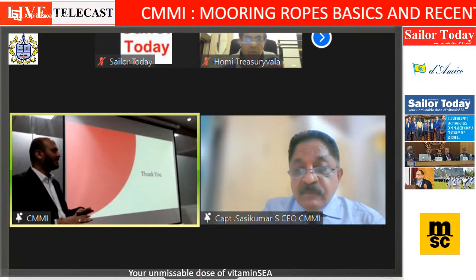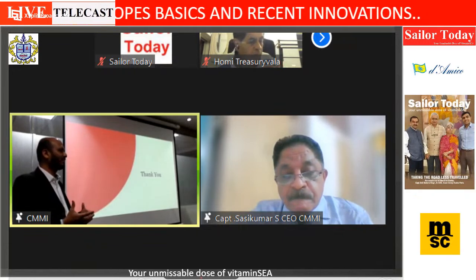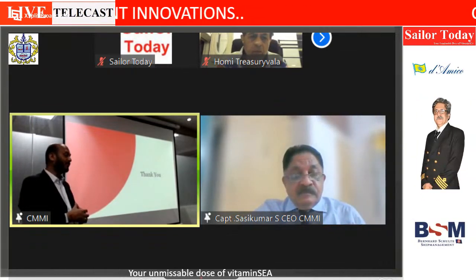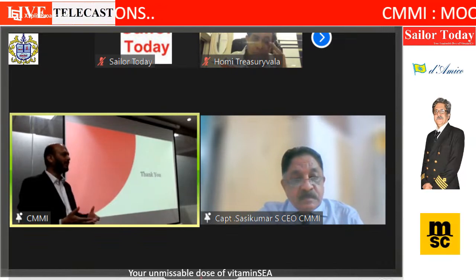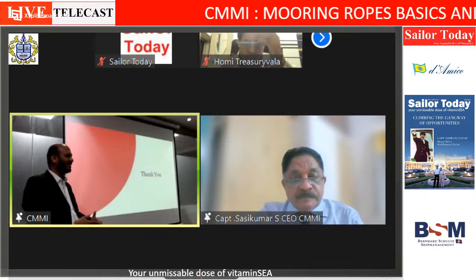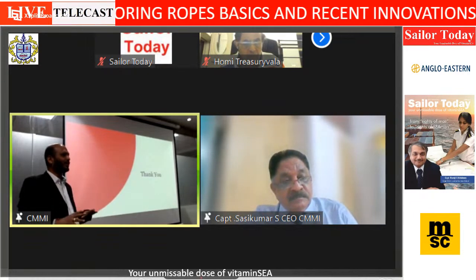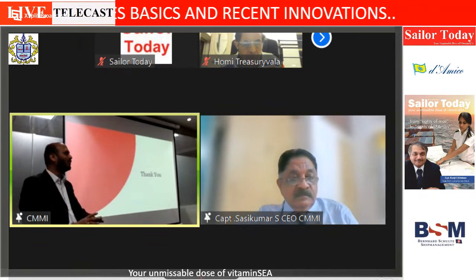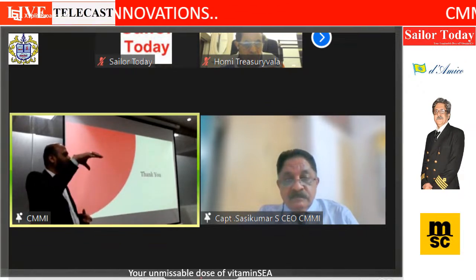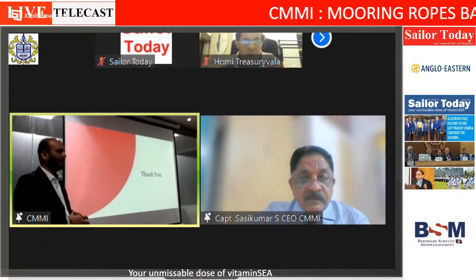In normal circumstances, it could also be very smooth sailing, right? But when the conditions are tough, this is where the rope's strength actually comes into the picture, and this is where it will cause issues. We have faced such issues as a rope manufacturer multiple times, where your rope broke in the first voyage. What has happened is the other ropes were of high elongation material. Two of our coils, and I'm sure most of the rope manufacturers must have faced this issue. It's not only GARWARE. It happened because at that port, at that time, only those ropes were available. So this is the mixed mooring we are talking about.